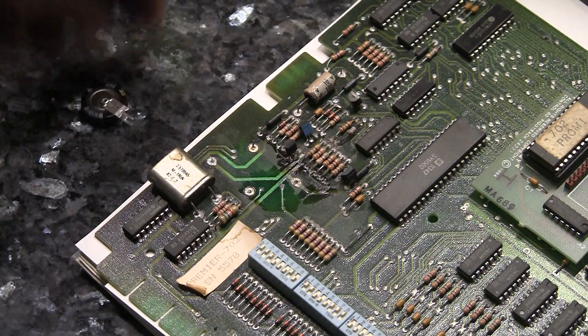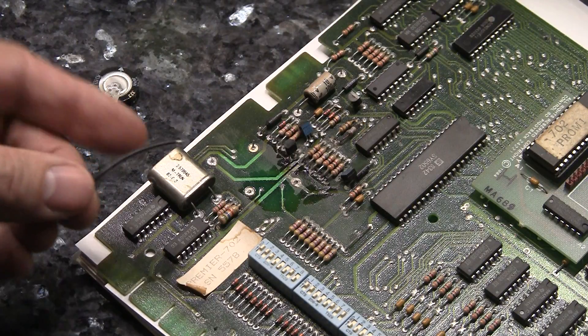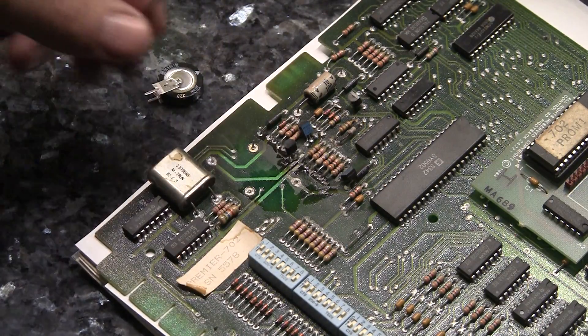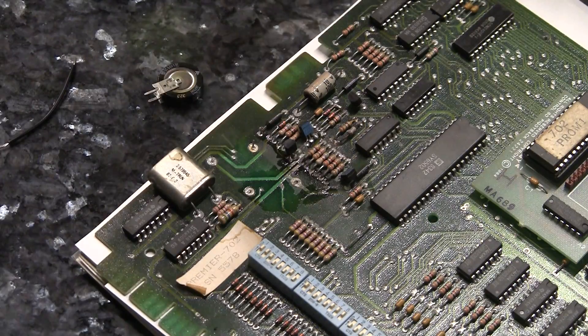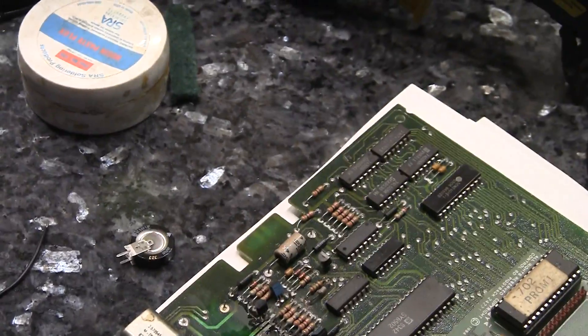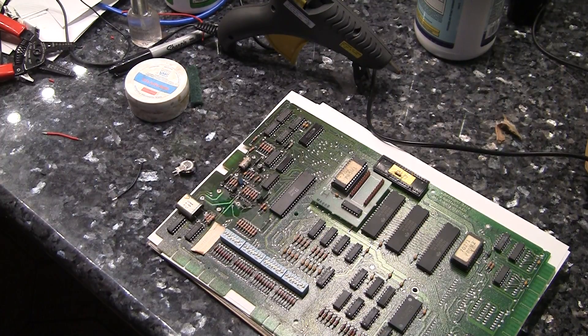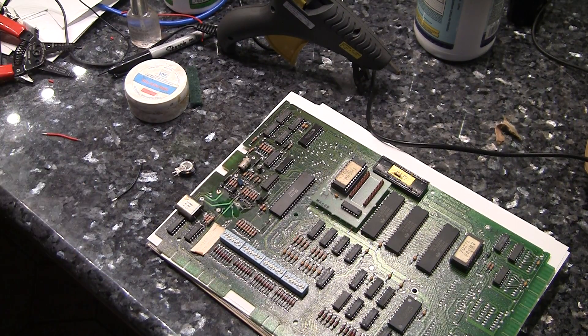So I'm going to let that dry, and then I've got little wires here that I've cut. I'm going to solder them onto the memory cap, let that dry, then solder them onto these terminals. And then I'm going to use the glue gun right there and glue the memory cap right onto that. Stay tuned for more. This is just a basic thing that you should probably do with every System 80 board that has the battery on — you want to get that battery off, make sure there's no damage, and do a memory cap, a regular battery pack with a diode, or a CR2032. I will show you the work in the next video. Thanks for watching.